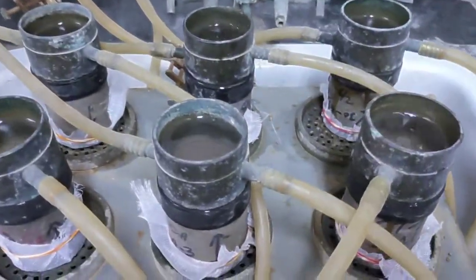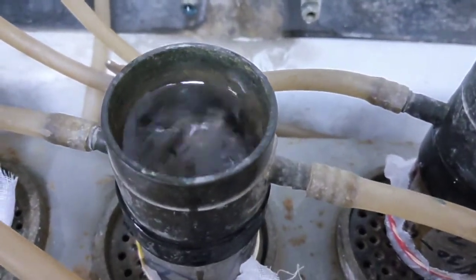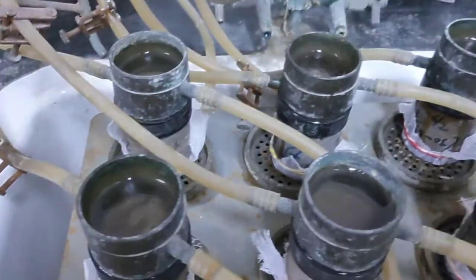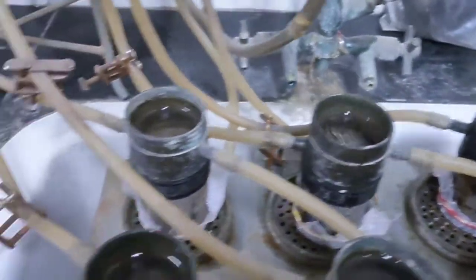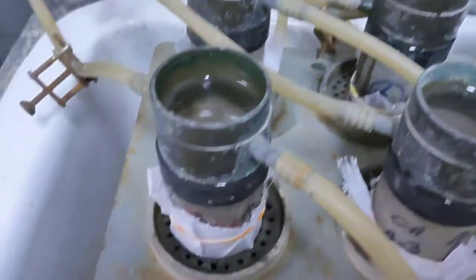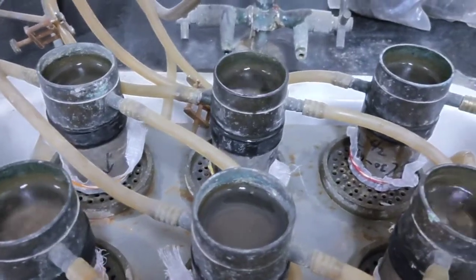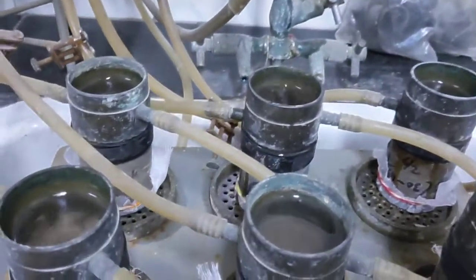The water is now nearly stable, though there are still some eddies and swirling motion. Because the apparatus has been operating for more than an hour, it should be reaching equilibrium and there will not be much improvement. If this swirling motion persists, you will need to take a larger number of samples to minimize replication error. Please note down that there is a swirling motion for this case.